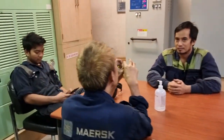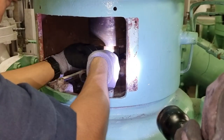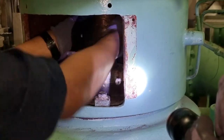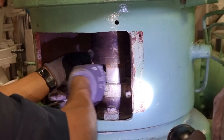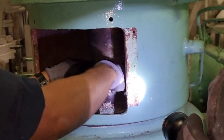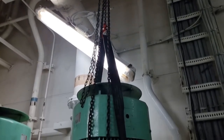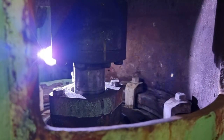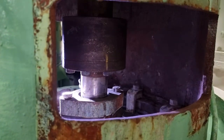So I boxed it up and went to the engine control room to inform our engineers that we need to isolate the electrical motor and the pump to see which one is causing or restricting the rotation. In this way, we will know if the problem is coming from the electrical motor bearings or the pump. It is very important to know how to do a proper insulation resistance check and winding check so that you will not need to disturb others for this kind of job.